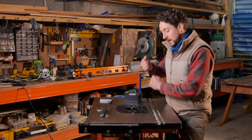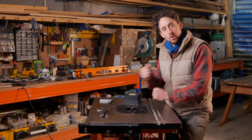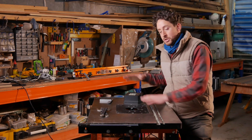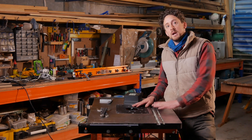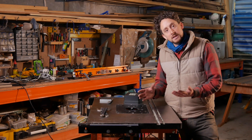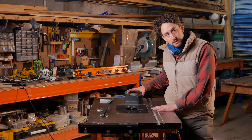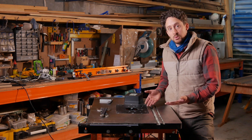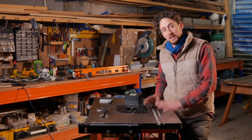It's very accurate, it's fast, and you don't need to move and lock like you do with a winding system. There's no need to use a hex key through the top of the table to wind up and down — in the past there have been times when that was impossible if I'm using a jig which covers the plate itself. A couple of things to note: it doesn't store settings. Whenever you change a router bit you're going to have to recalibrate, but you saw me do it and it is really quick. Whenever you hit the limit switch on the top or the bottom, which happens from time to time, you may need to recalibrate.